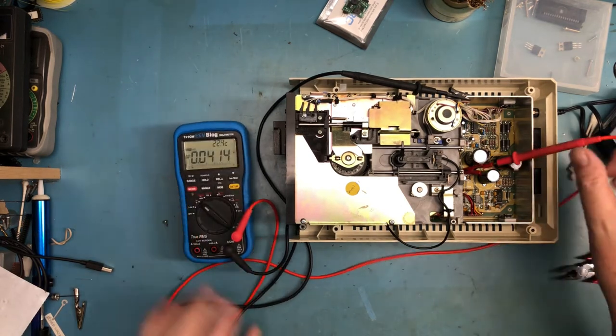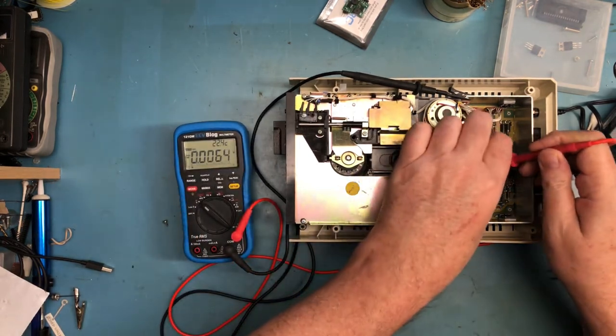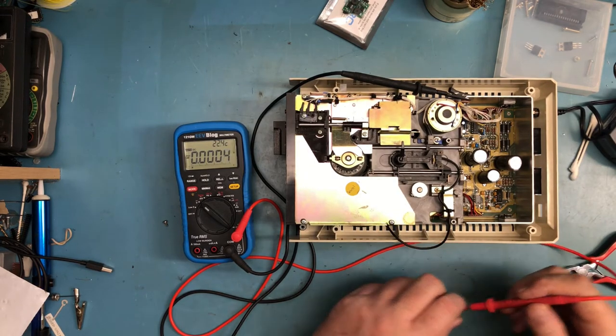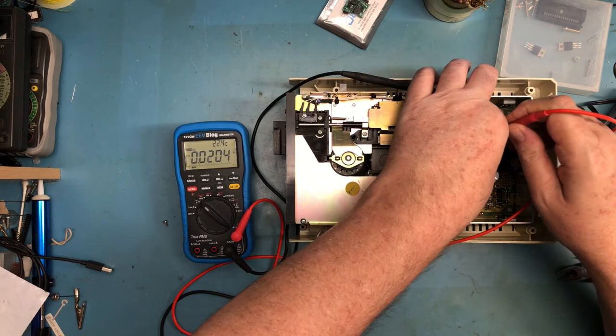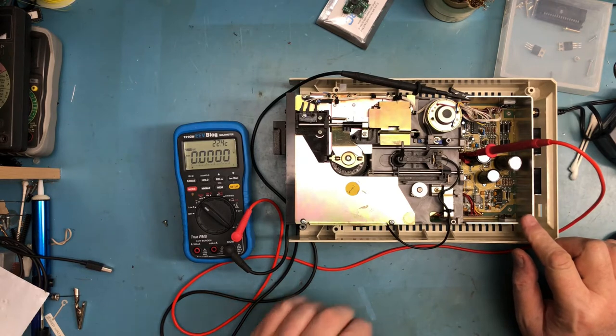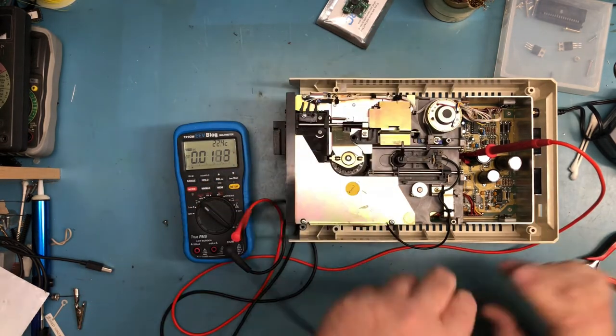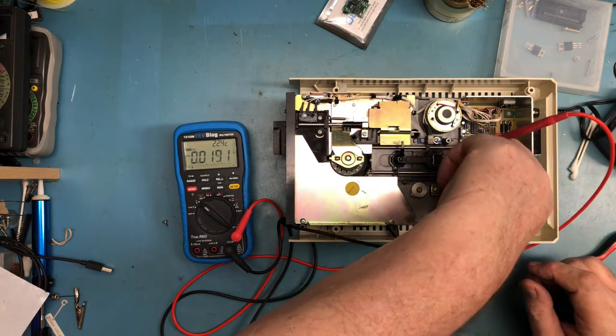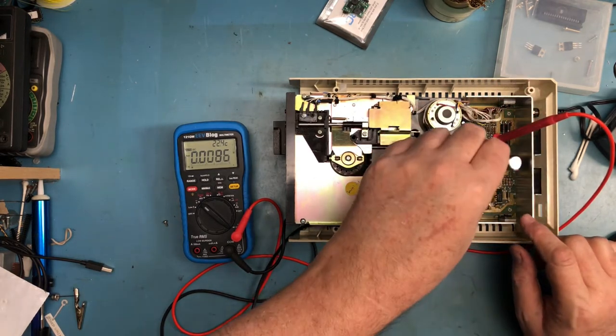DC volts. Point 14. Oh, it's floating because there's nothing to connect it to ground at the moment. That's why we're not able to measure anything. I do need to get on the ground test point down here. So the heat sink was originally grounded